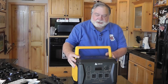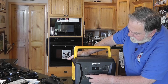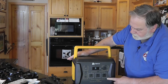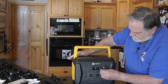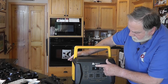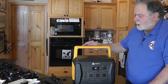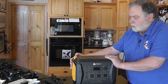Let's take a quick look at some of the features. You've got an input on the front, various places you can charge your phones and such. It does have USB-C capability that can handle quite a bit of power at once. Here are three regular 110 volt 60 cycle plugs, a cigarette lighter type power takeoff, and some regular barrel connector takeoffs. When you turn it on, it shows the amount charged, the power in, and the power out — right now it's at 34% after shipping. There are also two wireless charging pads on top for compatible phones.